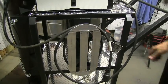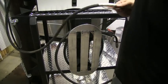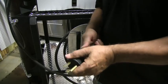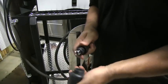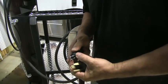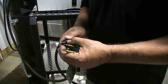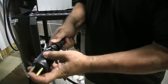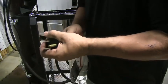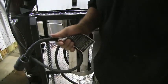I've got this little 210 MVP welder sitting on a big two-bottle welding cart that I built recently. I want to talk about this multi-voltage plug for a minute. It's really easy to swap from 115 to 230 volt — a really good idea for somebody starting out who doesn't have 230 volt power yet but wants it one day. It lets you use it as a 115 volt welder, and when you get your wiring done you just swap plugs and get the full power of the machine.